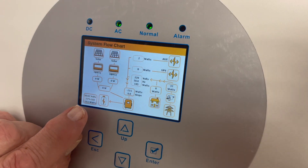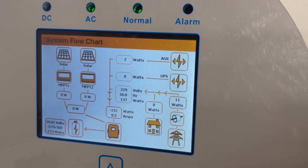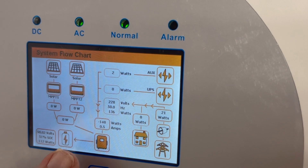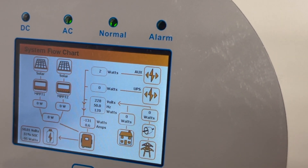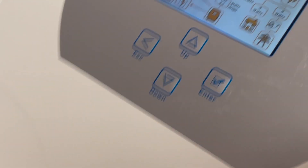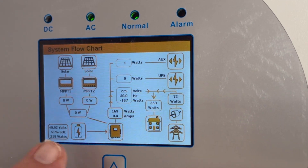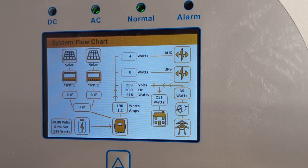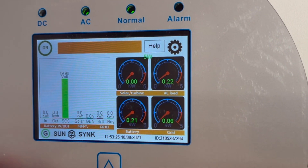If I connect on here, you'll see I'm now charging the battery — the battery is being charged with the energy coming from this inverter because I'm not using it. If I keep watching this and suddenly take some power out, you'll see what's going to happen: the battery reverses, it's now discharging. It's true AC coupled.